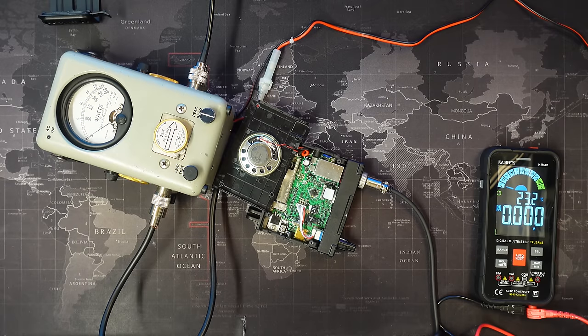So jumping the jumper, cutting the white wire, and then adding a blue wire in the next position and bridging that gap doesn't do anything at all that I can see. I've gone into the factory services menu and we only still have a power low option. I was hoping for a P2 mode so that we could control the high power in the high power mode and dial it back to 4 watts. My preference is to have a radio that's easily expandable in the case of an emergency, and really I want to be running this radio at 4 watts. But I don't want to have to open it up and start soldering stuff should that emergency event occur. So I don't know where we go from here.